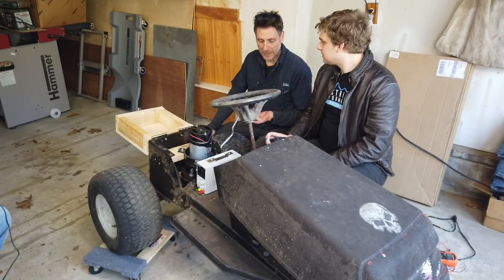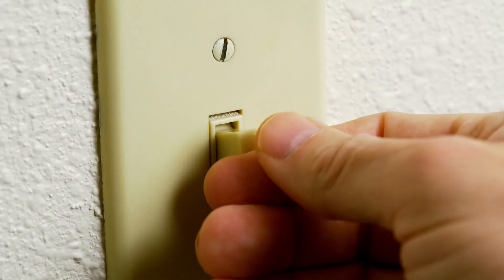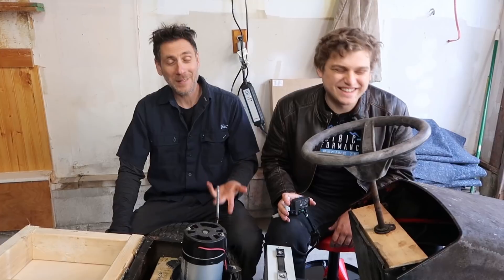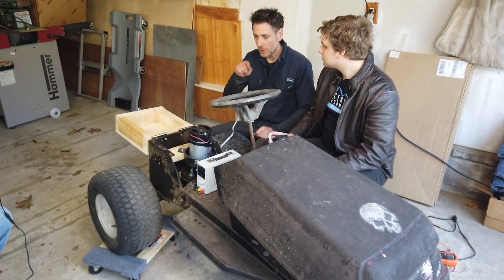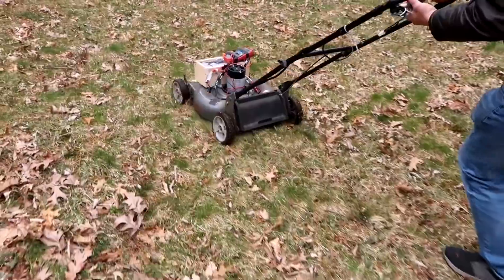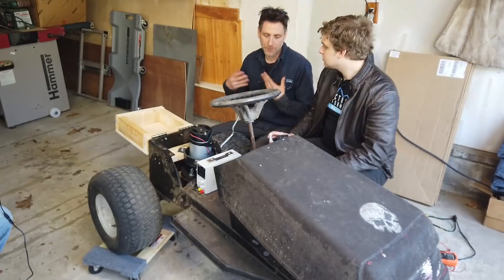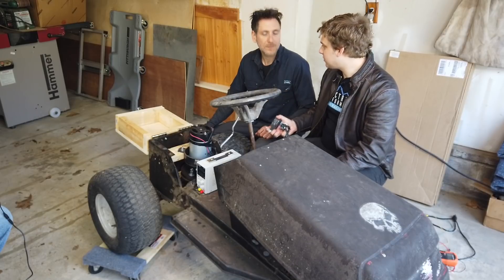It's like an on-off switch — a dead man switch. The on part sends all of the potential of the battery, like the way you flick on a light switch. That would be like getting in your car and flooring it — there's just no in-between, and that's not realistic. The lawn mower, whenever it got bogged down or we turned it on with a lot of brush and leaves, we spiked up to about 23 amps — probably even 25 or 30. That can blow fuses, and it's unnecessary. You want a ramp-up for something that's not constant. You don't want to always go 100% or zero.